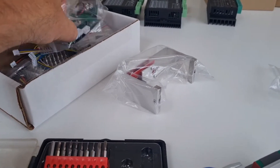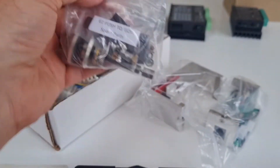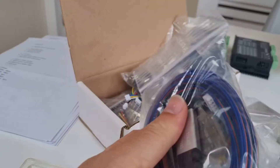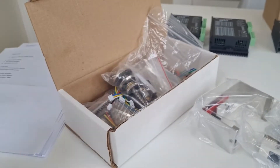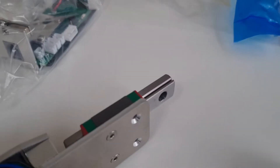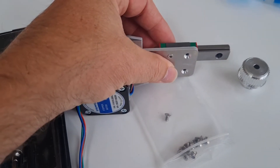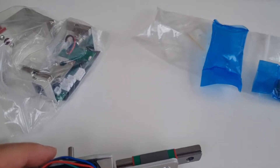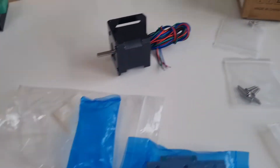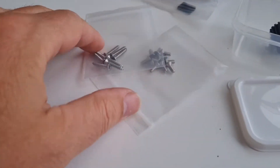In the box you'll have your altitude and azimuth encoders. You'll get a bag with the central bolt and magnet which you'll replace on your existing scope, the two-speed relay and power adapter parts, and a UART USB adapter that allows you to control your telescope using Stellarium. You'll also get two motor slides and brackets that attach onto the NEMA motors — these are standard-sized brackets, so you only need to worry about size if you change the motor for altitude or azimuth. You'll also get the focuser bracket, focuser parts, and tooth drive wheels.